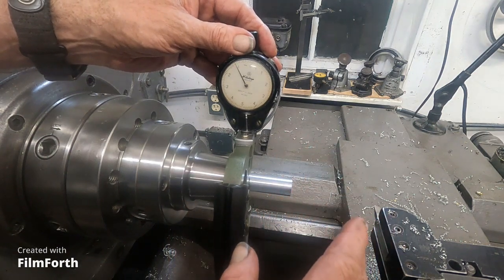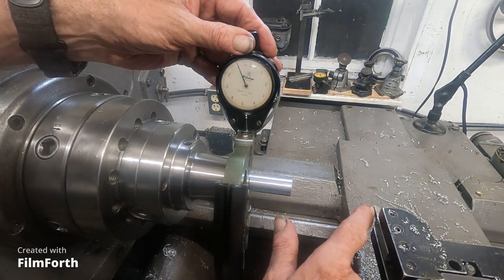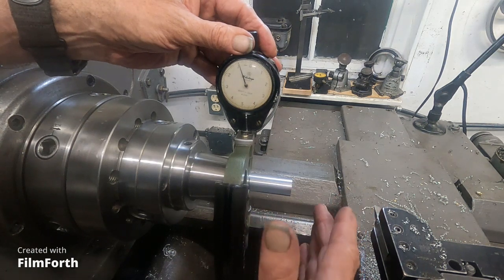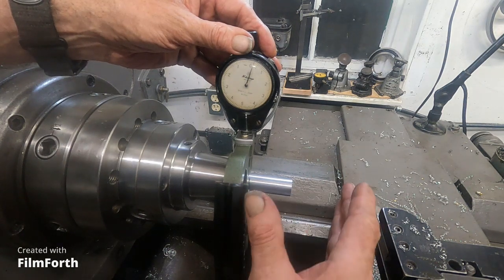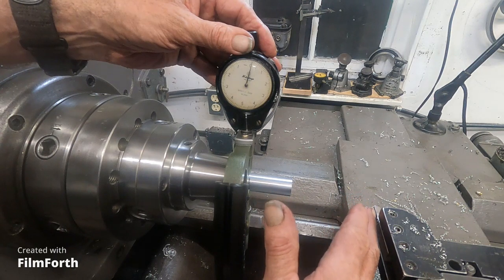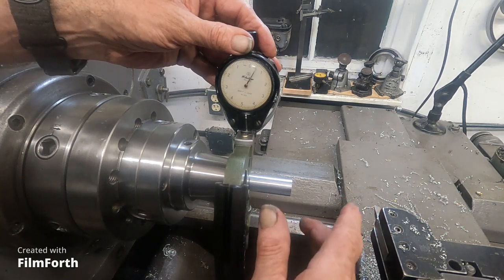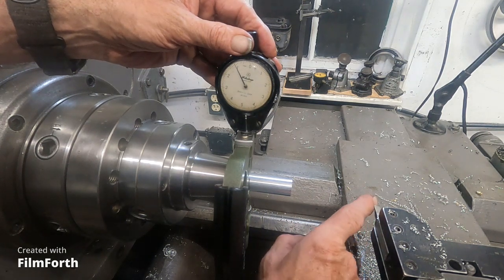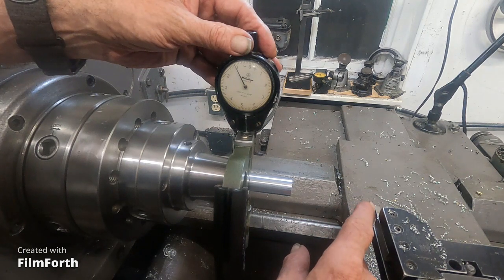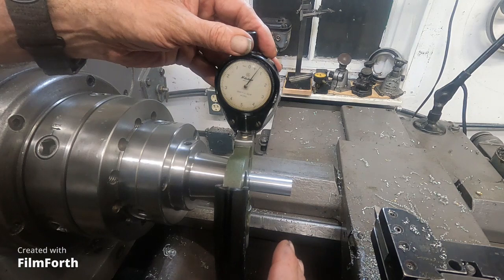And then the next thing you can do is increase the angles on the tool itself. And there's advantages and disadvantages. You can't gain in one area without losing in another. So when you start increasing the tool angles and decreasing the radius, then you start shortening the tool life because you have a weaker tool. And that's why I use this Micro 100, because it's really tough and chip resistant. So you're putting things to the limit here, to the limit of a basic carbide cutter. Okay, I will be back with improvements from here.